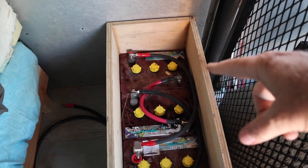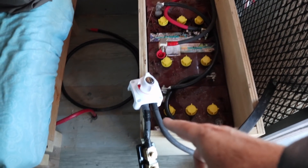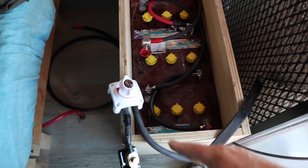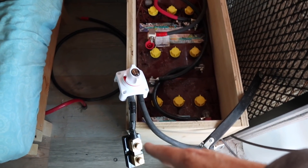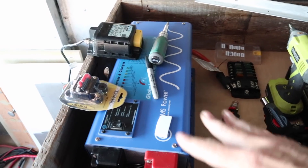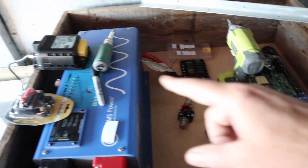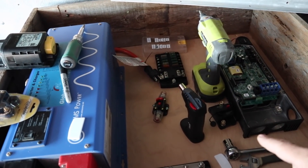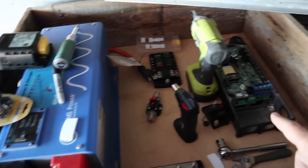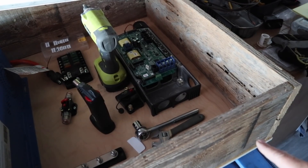It's end of the day, the sun is setting. We got a lot accomplished today but didn't finish up. Here's the new battery box — all the batteries are in place and wired together. We're working on setting up the shunt right now, along with a master cutoff switch and a battery cable that's going to connect to the negative terminal, then go out of the shunt up to the power box mounted on the wall. Here is that power box with the inverter, the fuse box, the charge controller, and the ACR unit. We just need to finish placing everything, screw it down to the plywood, and wire all these components together. There'll be a hole at the bottom corner where cables go down to the battery box, and a hole at the top corner where cables come in from the solar panels to the solar charge controller.